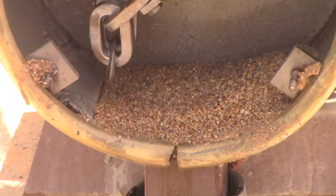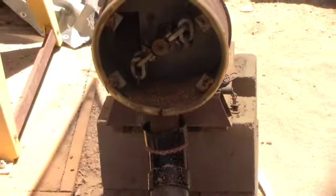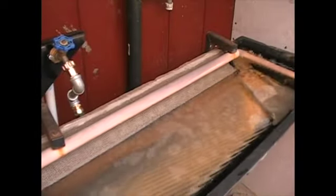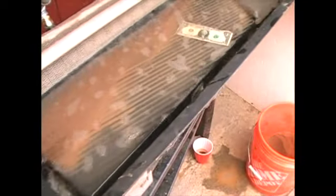Once you're done you want to clean out the inside of the impact mill — there is material that doesn't make it through the screen. Now when you start a run on the shaker table you want to make sure that you're getting proper separation. Once you've run it for a little bit, check to make sure the separation is good. I hate seeing money float across the table and down into the waste drain — yeah, just like that.